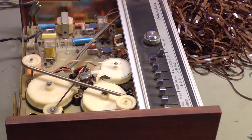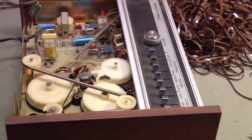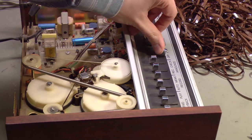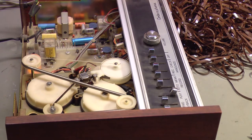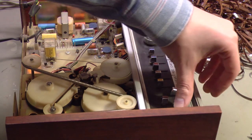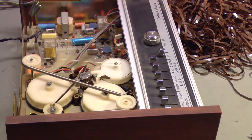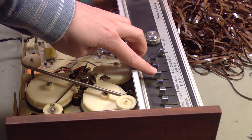It's back together and I've reapplied power. Let's first check the outgoing announcement. Hello, you've reached the paramedical labels — that works. I'll hit play and see what happens on the incoming tape. Oh, I have music on this tape. I should have bulk-erased it first. Still doesn't sound very good. I'm surprised. Maybe we do still have a head problem, but I cleaned it pretty well. We can do a memo record and test out the incoming message tape without having to make a phone call to it.